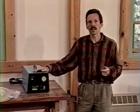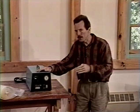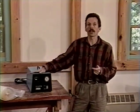A 2-minute test can avert a major disaster. In terms of pump maintenance, the main thing I recommend to keep it running smoothly is to purge after pressing. This simply amounts to letting it run for about 5 minutes after you remove your project. During a pressing, moisture from the glue is pulled down into the pump. If you turn off the pump and then remove your work, the pump sits with that moisture inside it until the next time you pull it out.